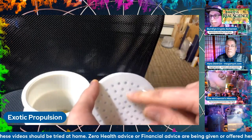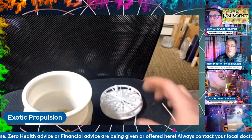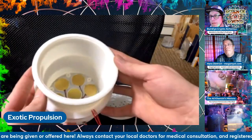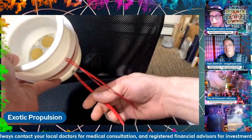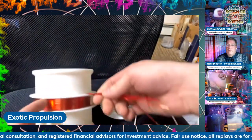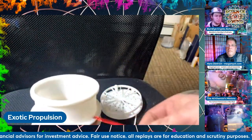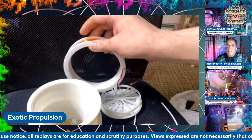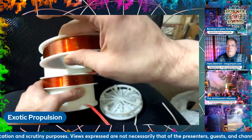I left the original 3D print first layer raft on because sound waves can still get through it. I can drill these holes out if I want to, but sound gets out plenty well. At the bottom there's a series of seven piezo transducers, and they're all wired in parallel, and they connect to the same two-gang wire - these are speaker wires. The bifilar center coil is just one layer up and one layer down with two wires, side by side, both the same length. And I've got a second coil so I can assemble this with a Helmholtz array using two different coils.